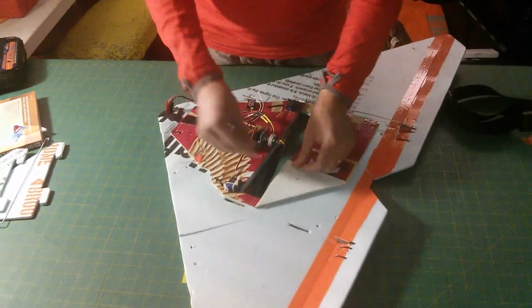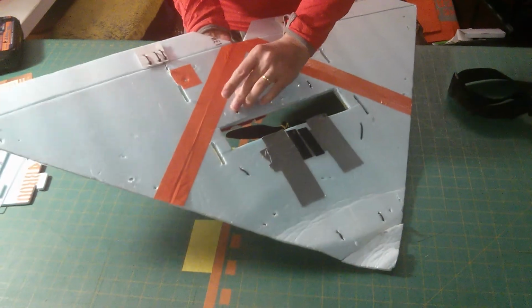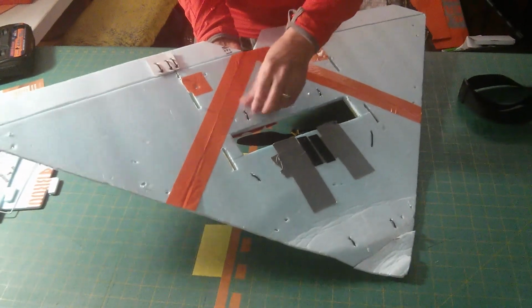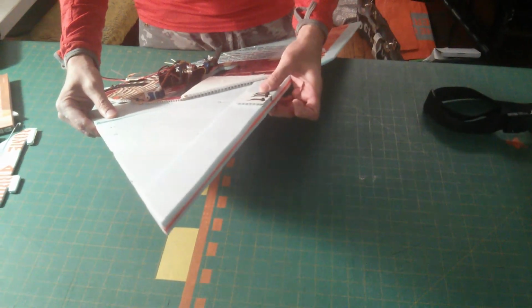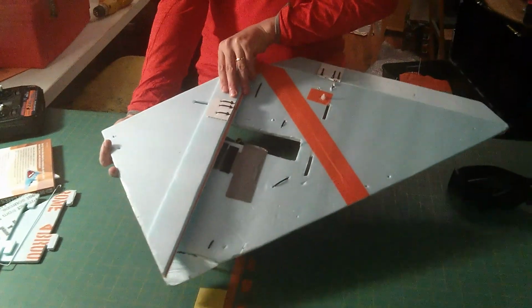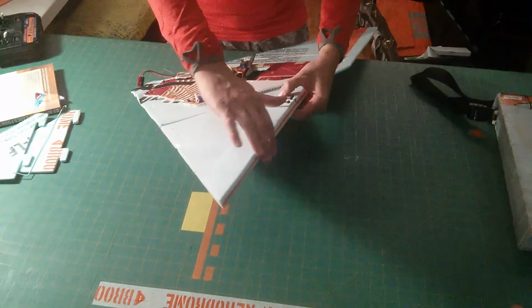All right. And then what I do is I just shove it. I put another hole in there, and I shove it in there. And then I put the nut on the other side. It's got a little storage spot there. All right. And so now we can see how it folds. So this folds like this, all right? And then I can fold it like that. That's the idea. I'll show it to you again. So this Elevon folds into the surface with this top hinge.